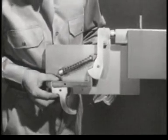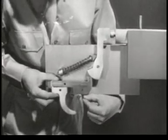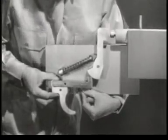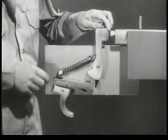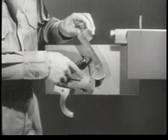To cock this firing mechanism, we can use the same sear, trigger, and sear spring that we used before. When the hammer is pulled back, the sear snaps up into this notch and the weapon is cocked.